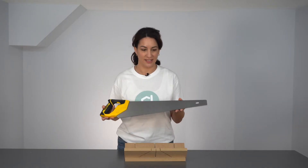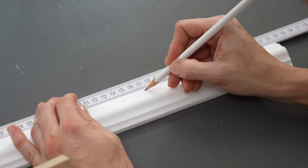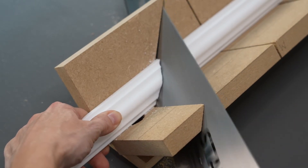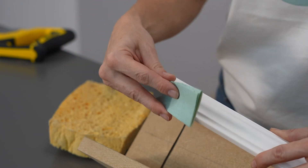Use a suitable saw like this with rough teeth to cut the high density extruded polymer chair rails. Put your chair rail in the miter box and saw it in the direction that you marked on your profile. Repeat these same steps for the long sides. It's necessary to take some sandpaper with 150 grit or finer to level the edges where you cut them and try to make them as smooth and even as possible.